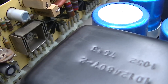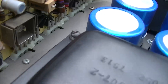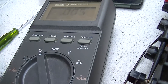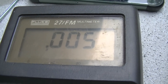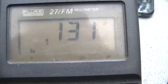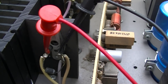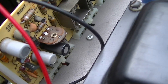The way these connectors work is just that — not real impressive, but who am I to question a great American manufacturer like Harman Kardon. Here we go — do we have smoke and fire or do we have success? I have the meter on the output and here we go — power on. Looking good. The offset is off a little bit and we have 0.345 volts bias on this side, which is way off, and 0.3 on this side.